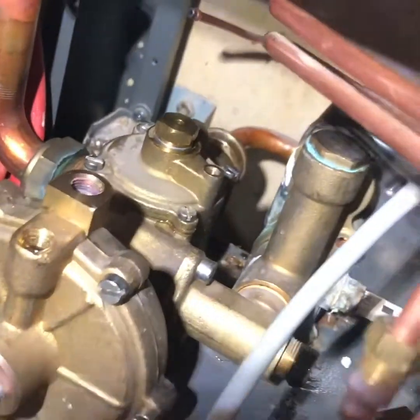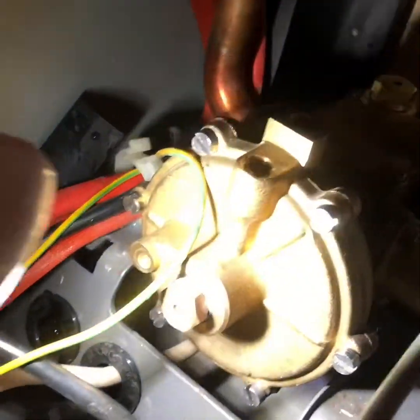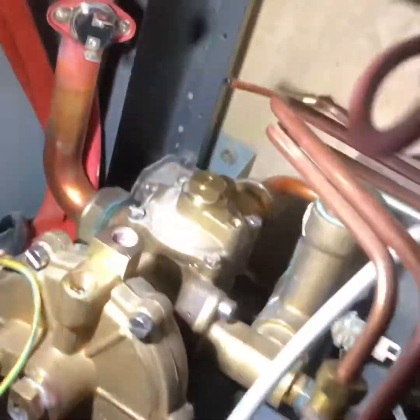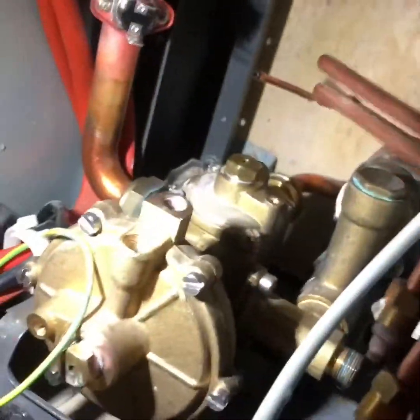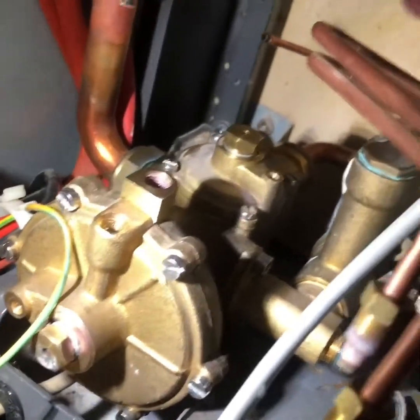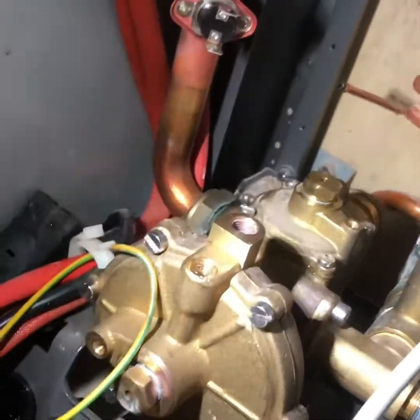It's proven extremely difficult without basically removing the cover completely, so I can get two pipes. But the more I look at it, I don't think I actually need to take it out, because I'm only going to be changing a diaphragm in there and a diaphragm in there and various plungers that go with it. Could be wrong, but I can't see much more to it. So basically we'll replace those two, see what's left in the kit.